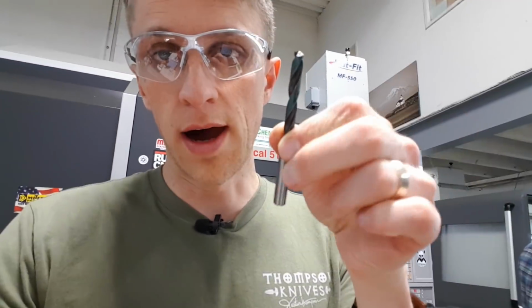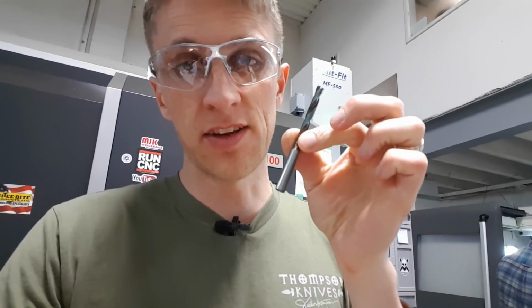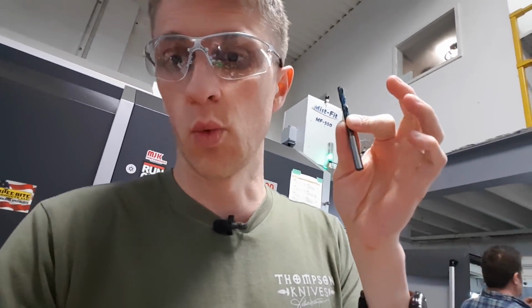So it is time. I got new through-coolant drill bits this morning. Time to put these back in, try them again. Now that I have the runout dialed in on these tools, or the alignment, whatever you call it, X and Y, should be a lot better. We'll see. We're doing a short one that will be a pilot hole, and then this one will go in and be guided.